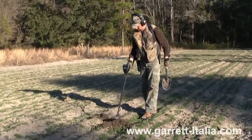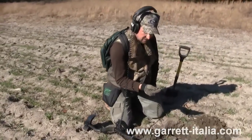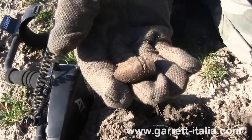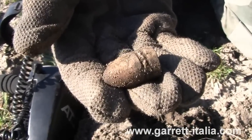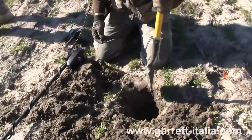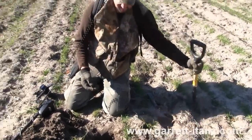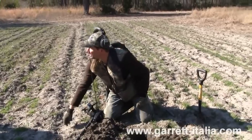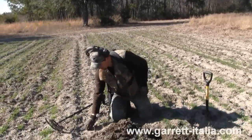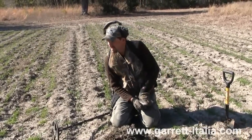Some targets will be so faint that it will be important to wear your headphones to hear them. Here's a two-ringer — this one was deep. I was working in Pro mode, and as far as a signal, it was very, very faint, so I dug down some of the soil. But it read real high — a good solid piece. Look at the depth on this; that's well over a foot, very deep. It didn't read on the screen — it was so deep it wouldn't give a numeric Target ID. I was getting a high, consistent signal — just deep sound, real high sound. So if it sounds good and it's deep, go after it.